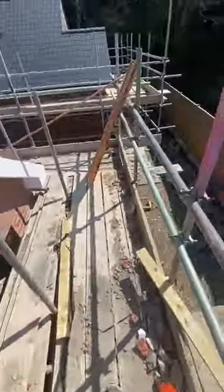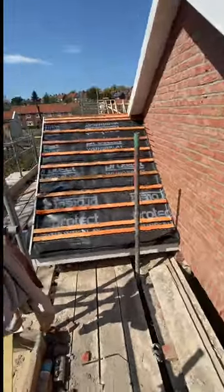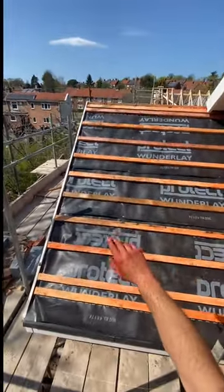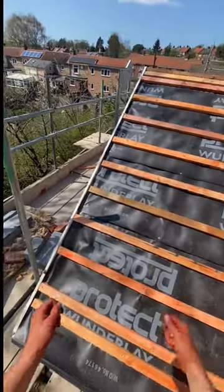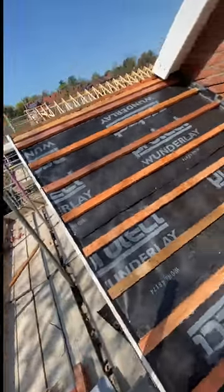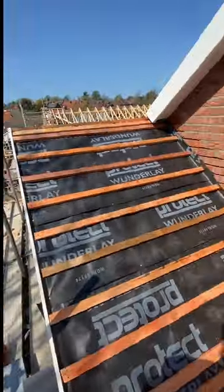He's cuddled in — look at that, good lad, he's doing all right. Ryan made a typical schoolboy error. I cut one batten down and said you can cut ten of them, but instead of using the original batten every time as a template, he marked it, cut it, then used that one. By the time he got to the tenth one the batten was way out. There weren't much dramas — I just had to cut a couple down, well most of them, but it was all right really.